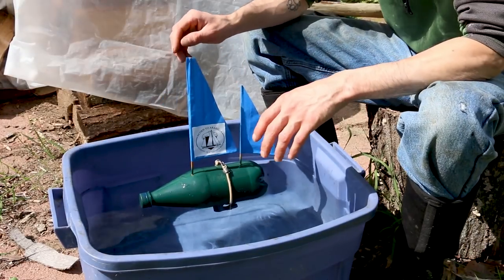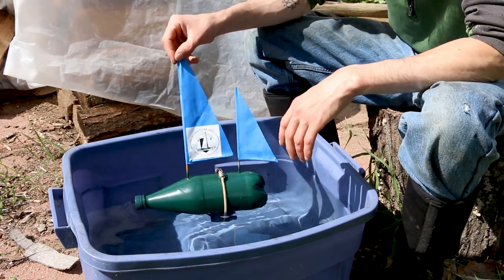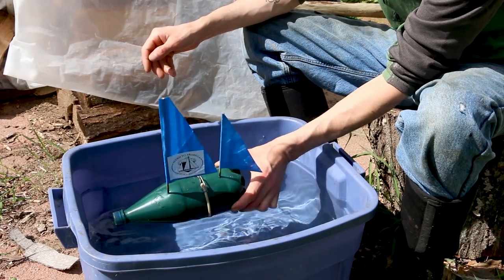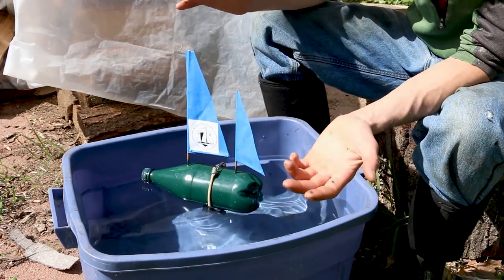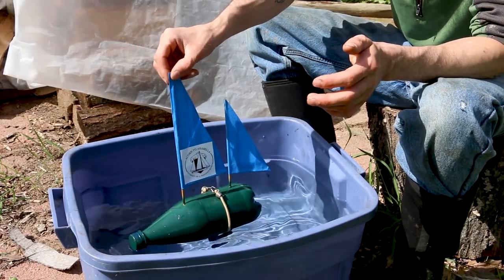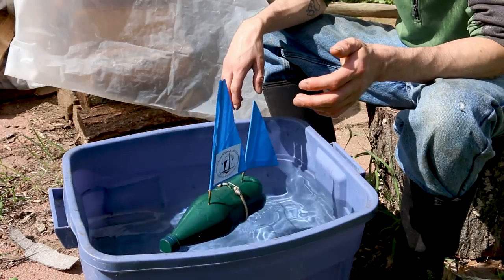So before, with very little ballast, it didn't take much effort to push the sail over, so it had been really tender. But the upside of that is that the roll speed, how fast it goes back and forth, is slower. So yeah, you tip farther, but you do it a lot slower. You add more ballast, and the motion gets faster. So yeah, you don't heel as much, but when you do, you come back a lot quicker.